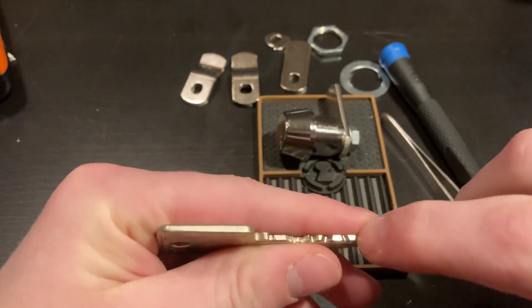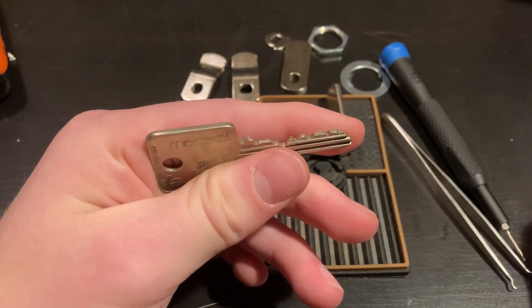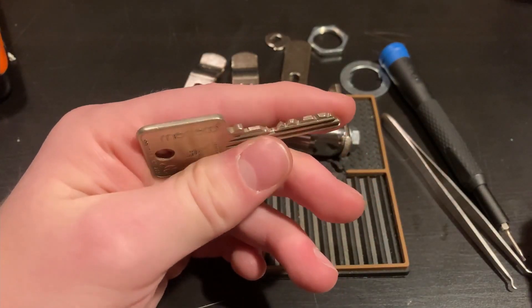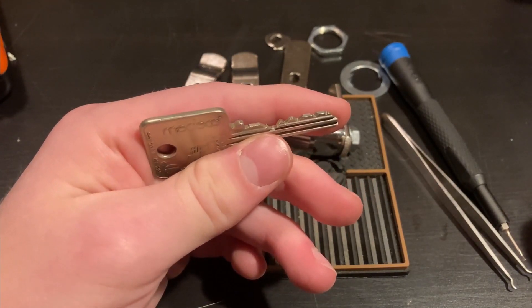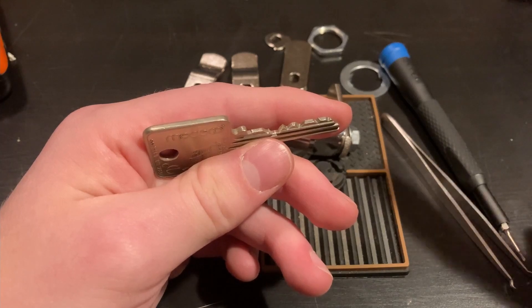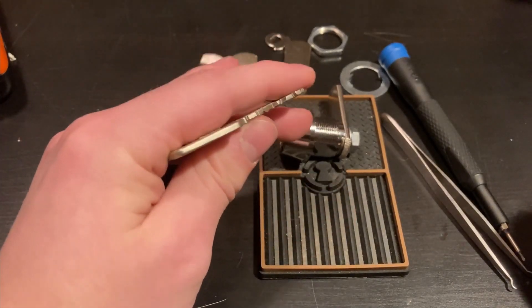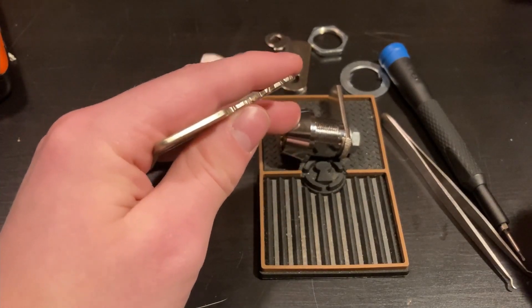You have your angled bittings which determine the rotation of the key pins in the lock. In a biaxial, you've got six positions: left, right, center, and then fore and aft for each one of them. I will show that when I take apart this lock.